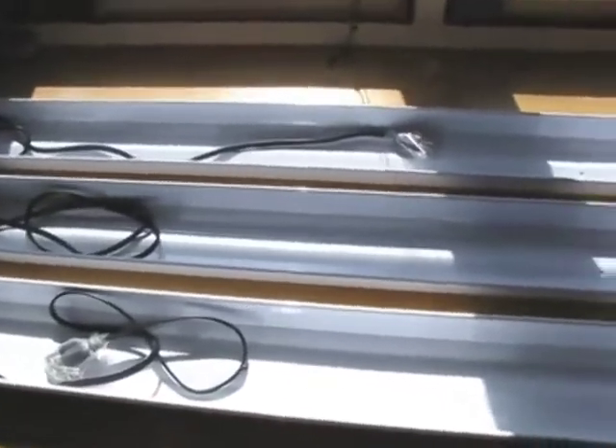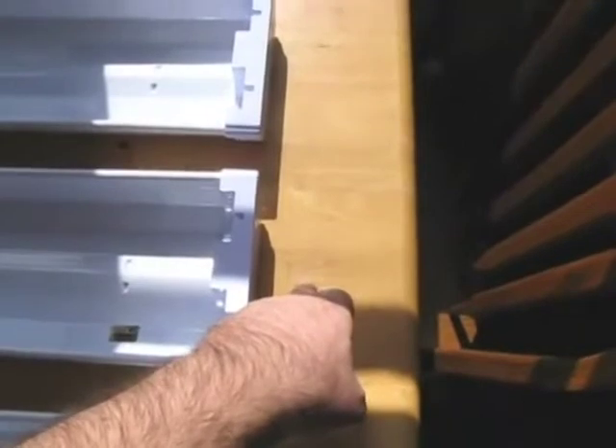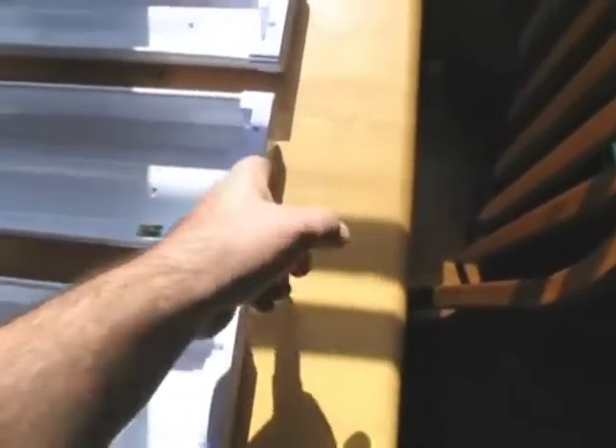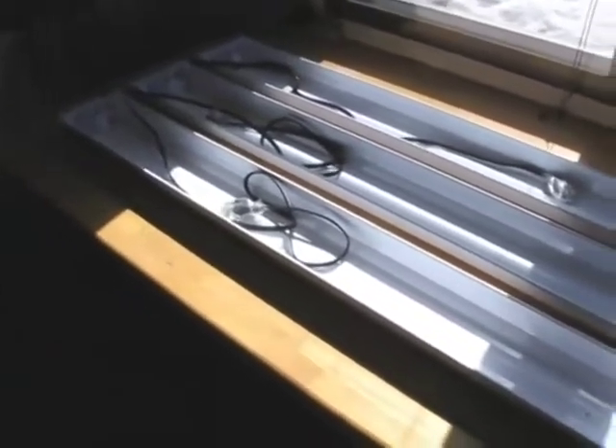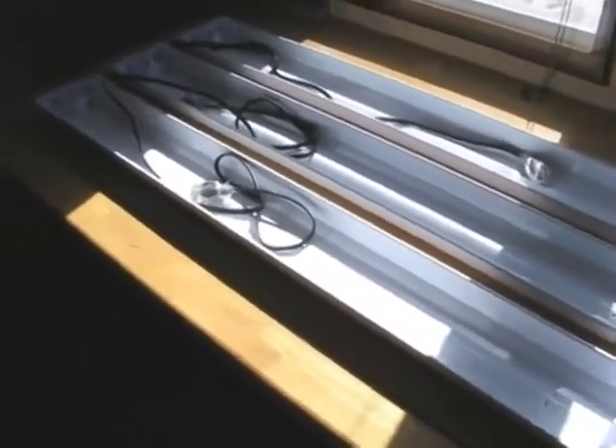My board size is going to be 19 inches by 53 inches, because I want a two-inch overhang on each end. These lights are mounted to the plywood all as one piece, and the plywood will come out to about here. I'll put an eye hook in here, center it where it's balanced, and eye hook in here on both ends — that's where my chain will be linked so I can raise and lower this light assembly up and down. I want the overhang so I have somewhere to mount the eye hooks on the edge. Now I'll go find a piece of plywood.